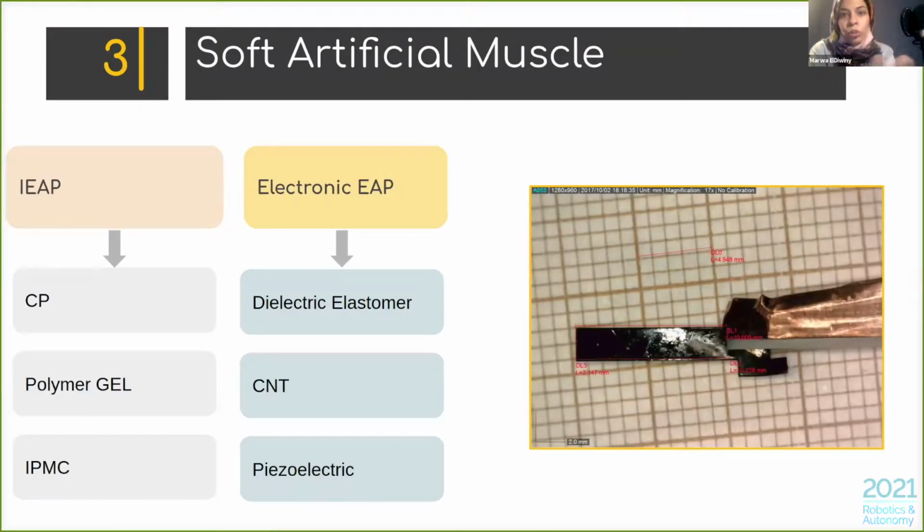So when we look at the soft material, especially here, what we call a smart material, we call it smart because it can actuate itself as well. When we apply voltages, for example, in that case, you can get this kind of mechanical performance, and it can also be used as a sensor. So what's really beautiful in ionic conductive polymer is that it can be used as actuator and sensor at the same time. And of course, if you can imagine, if we want to design any kind of passive material, you sometimes have to be bothered with how I can design the sensor, how I can embed the sensing network in the material.